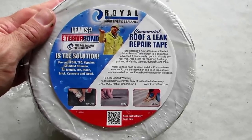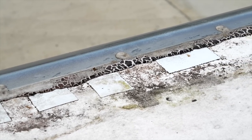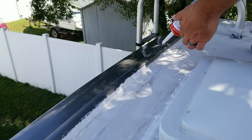The most simple DIY way to fix a leak on your rubber roof is to patch it with a butyl putty tape, Eternabond being one of the more popular brands. This works well for sealing small holes but it looks terrible, as you'll inevitably continue to add more and more band-aids to your roof over time. But let's be real — if you're watching this video you're likely well beyond slapping band-aids on pinholes like we are.